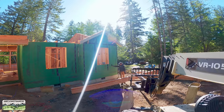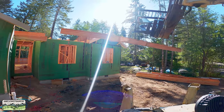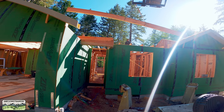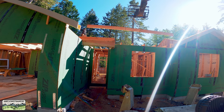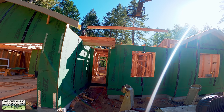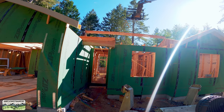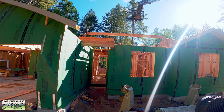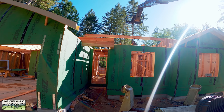Coming around the corner I realized I needed to put the hats on those beams I just brought around back — hangers for the beam you just saw as well as another beam in the back of the great room, all supporting rafters and ridges. One beam was a five-and-a-half by 15, about 32 feet long. When we rig it we find dead center and space it off so the beam stays level, but the person on the other end can easily raise, lower, and pivot it. Kyle aims it right for the beam pocket in the wall — we keep the top plates connected while framing so we can drop the ridge beam in and then cut it out.